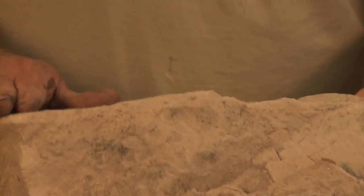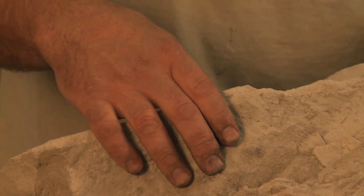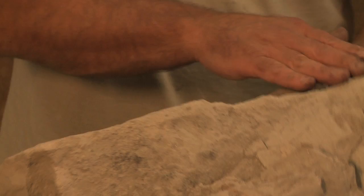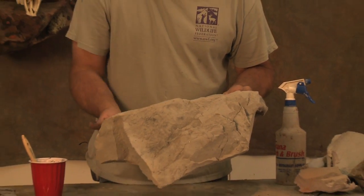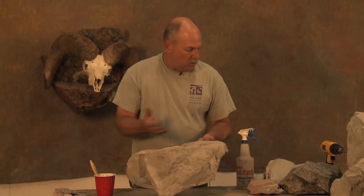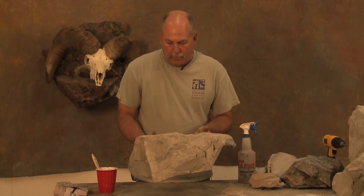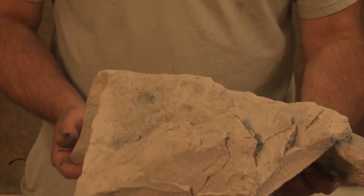If you don't seal your seam, then what will happen is all of this paint will soak in to that joint compound mixture that we used, and everywhere where there was a seam, it will just absorb all of the paint and it will be black. So make sure that your seam is sealed really well. If you don't seal with the River Rock, you can seal with a polyacrylic, you can seal with shellac, you can seal with all kinds of things. You just want to make sure, using this wash technique, that the seam is sealed very well.